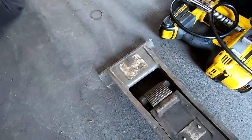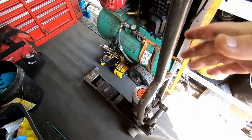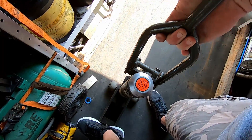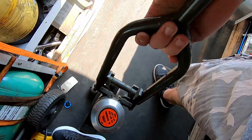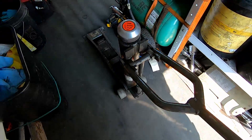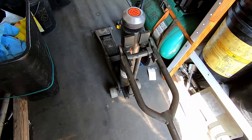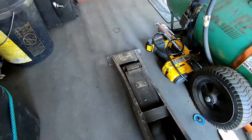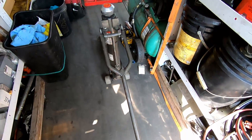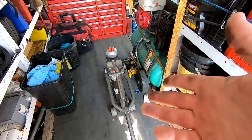Basically you roll this up and tuck it underneath the counterweight, which is the backside of the machine. Then you take the handle, lift it up and spring-load it, tuck it in like that, then just do the pump action after you tighten it down — and then that piece right there comes up. That's basically it for your standard forklift mechanic jack.